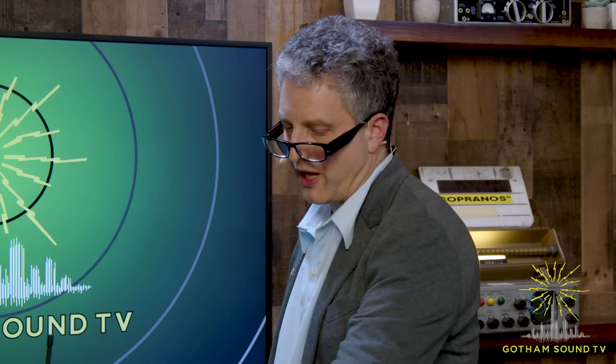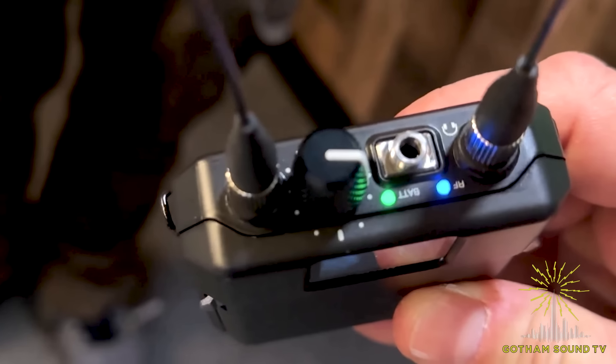On day one with this product in WMAS mode, you could put that one frequency on two antennas in two locations and have zone coverage without any external hardware right off the bat — that's huge. And additionally, you could just put up a second antenna to get more robust coverage in that area and have the ultimate in reliability. I can see all kinds of uses in the film world — eight mono feeds in one 800 kilohertz slot. We talked about boom one, boom two, boom three, all getting very high quality low latency feeds, plus the script supervisor and the director getting their own feed. But I could also see people using this on a reality show, like an installed reality show, where you're sending camera mixes to cameras and putting this pack on a camera and just using the headphone output as an output.